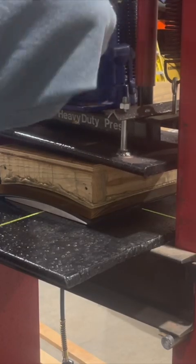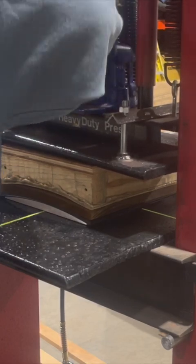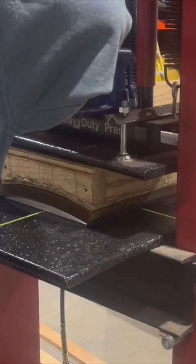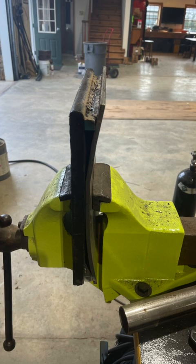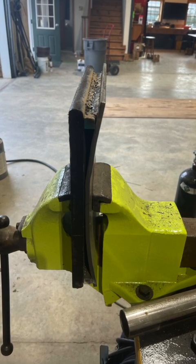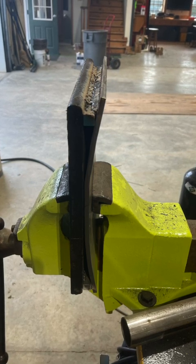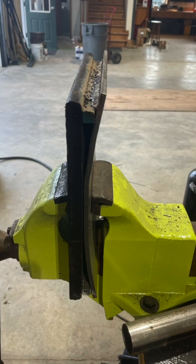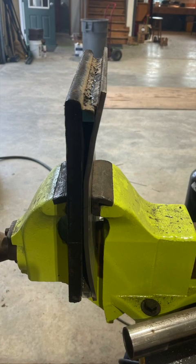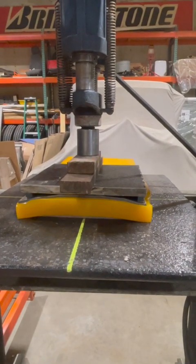That's my 30-ton press — later on we're going to see the 50-ton. That's pressing some panels. That's a pressure plate I made because I was using that giant heavy concrete one. I used a piece of three-sixteenths round steel with some stock that I really sloppily stick-welded on the edges. That was my new pressure plate. Here's how I was using it on my 50-ton press.